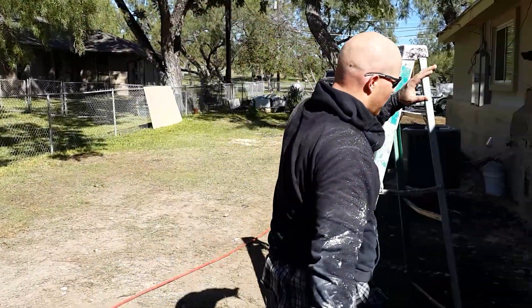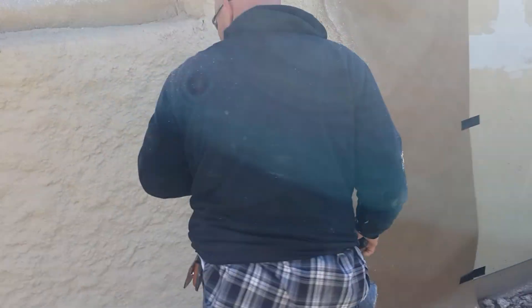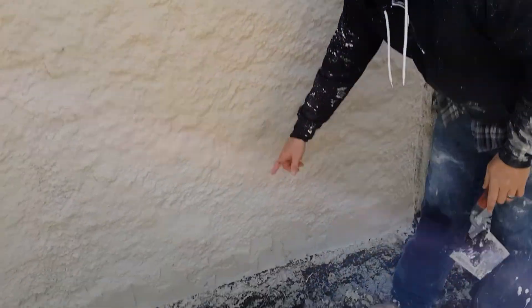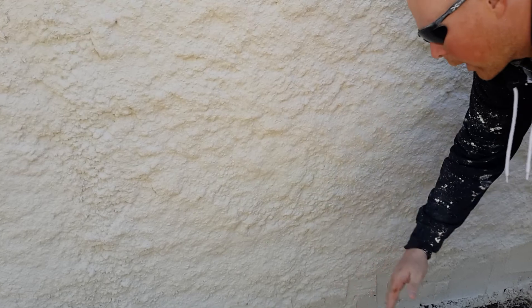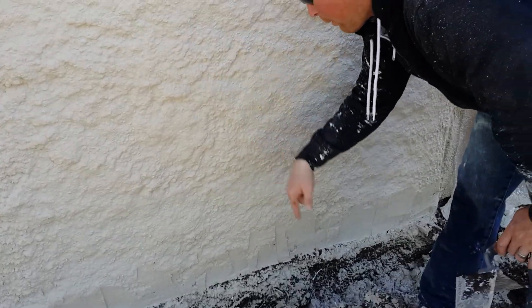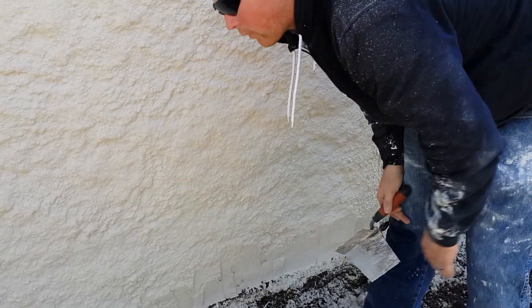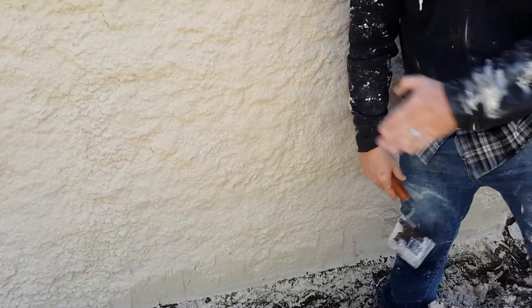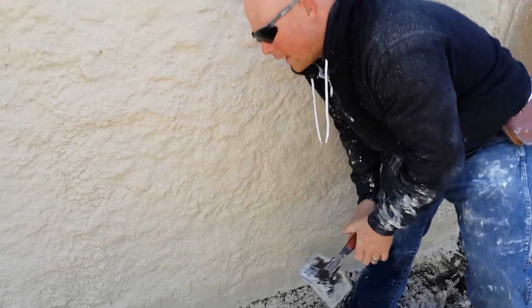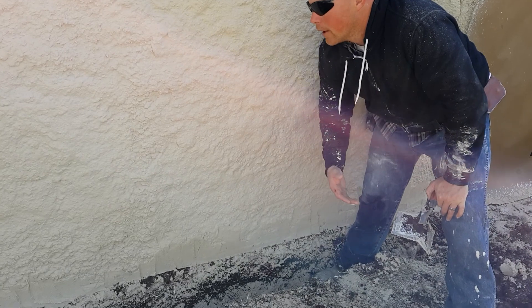Here we did this wall — we've already blown it and whatnot. My guys come in behind me, and they'll teach you most of this in training, but if you don't notice right down here — look. As you blow a wall, you'll notice that the stone, because it's clumping up, it'll always roll out like that. This had a trench in there, but my hand Johnny came in with a straight edge and went straight down, took it straight down. Now all you have to do is kind of rub out the lines, do a kiss coat on it, and it's a straight wall going straight to the ground. It doesn't roll out and bring that bubbly effect that some people would expect. It's just another way to make this product look like it should.